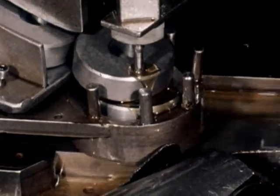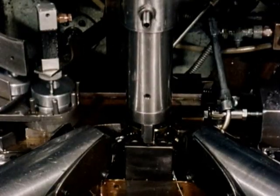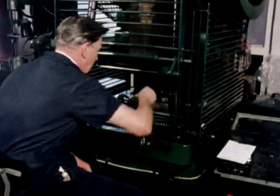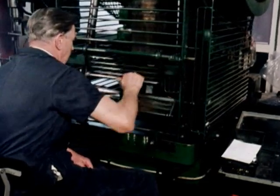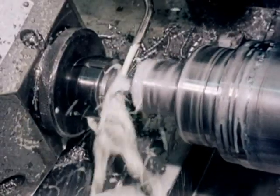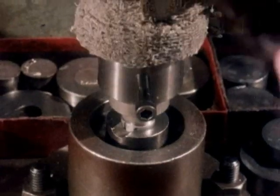To produce a circular screwing die, the steel bars are faced, drilled, chamfered and parted off to form a blank. The face is then ground to a close tolerance. The blank is notched and the closing-in dimples drilled. On certain sizes of die, the lead is punched on this press. The face holes are drilled and then the blank is marked with its size, thread form and our name.